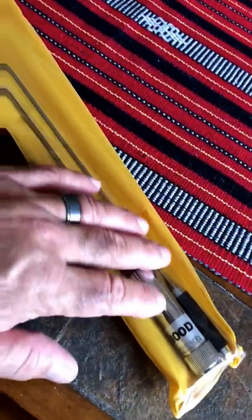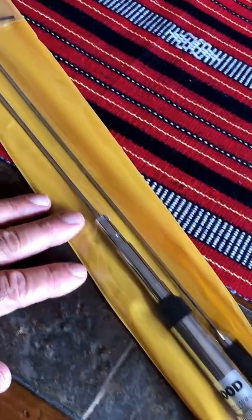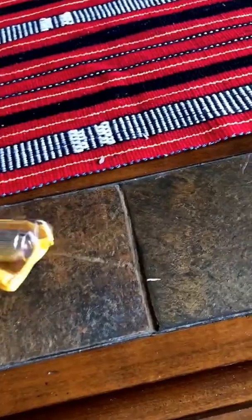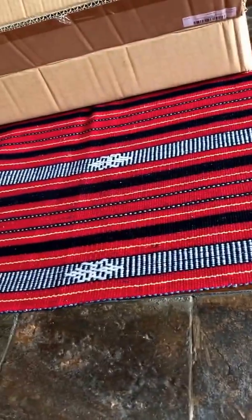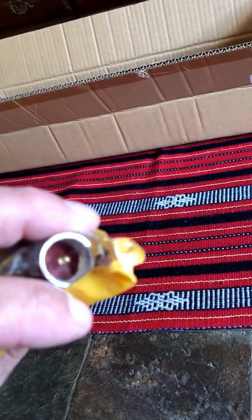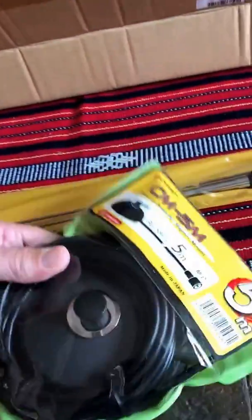Two pieces. I'll put those together with my SWR meter. We use this included Allen wrench to adjust the length to get the lowest ratio. So anyway, oh, and also with this antenna, you'll need an antenna mount that will fit for SO239. That I purchased separately, which is right there.